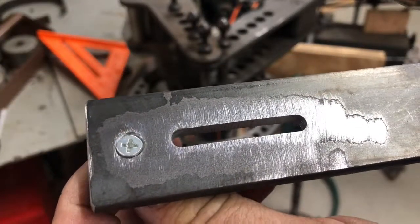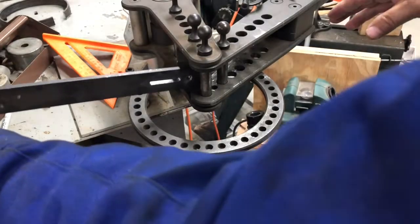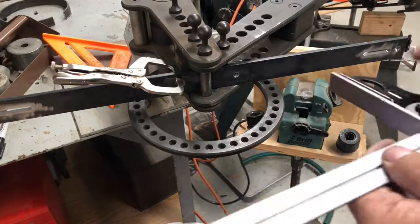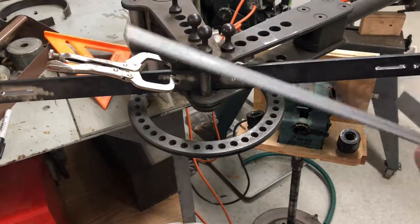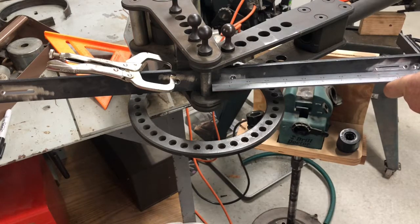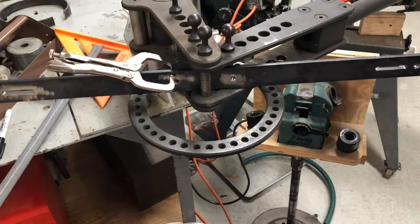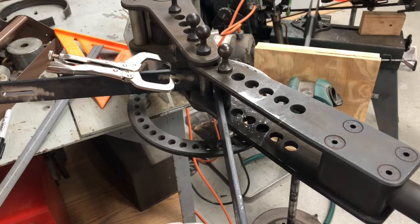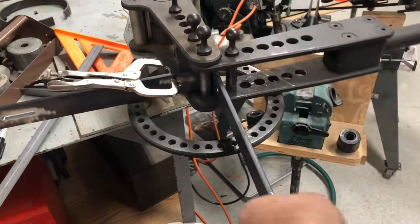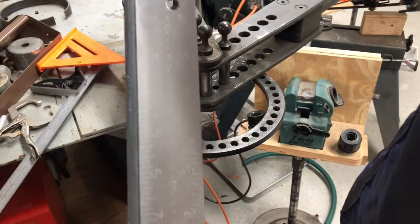I got that nice and flush for my deck screw. Now I take this straight bar and put it into my compact bender, and I want to bend it to 90 degrees. I use my combination square — this is an 18 inch combination square. I put a little tension on the bender and with my combination square I measure both sides equally. I pull this around and make a 90 degree bend. There we go, that matches pretty good. You always got to work on that spring back.